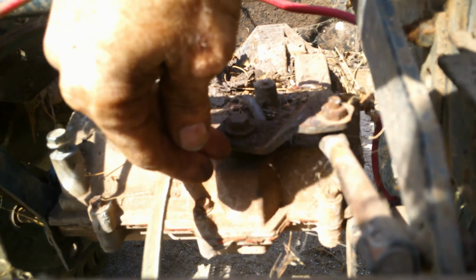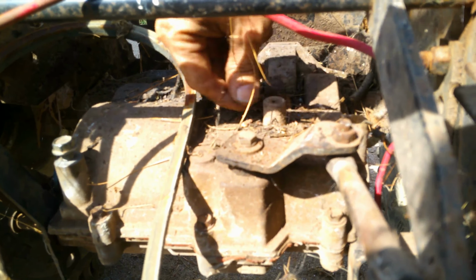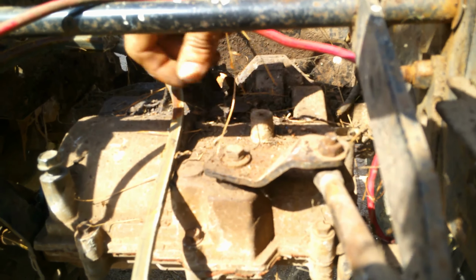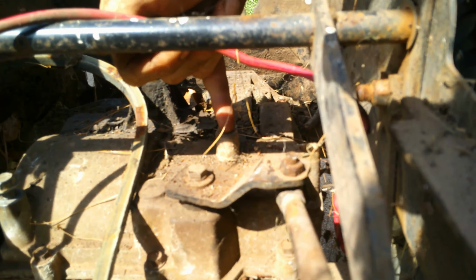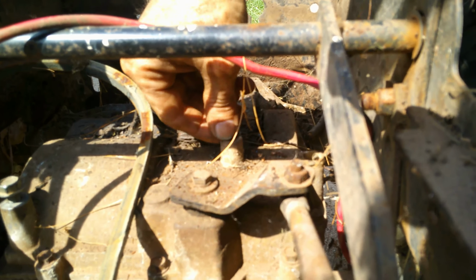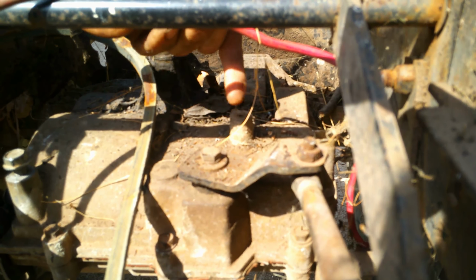And also on this one, not all of them. I was watching a video of you guys. This is the shifter. It comes across, gives your reverse and all right here. And there's a key in there that you gotta pop out in the top case before you pull. If not, there's, watching him, if you don't get that and you get it back together, there's a little ball and spring in there. Right here is where a ball and spring goes. You gotta undo that. Take out a little cap. It's a little place where you put a thing spinning out, but anyway.